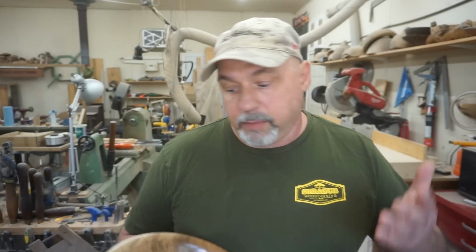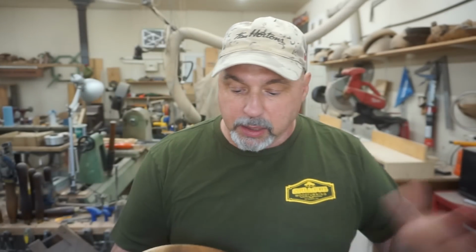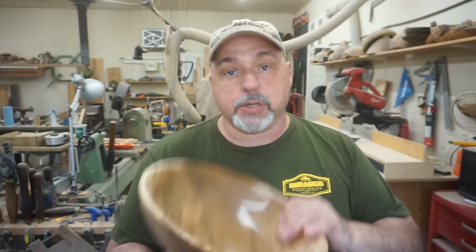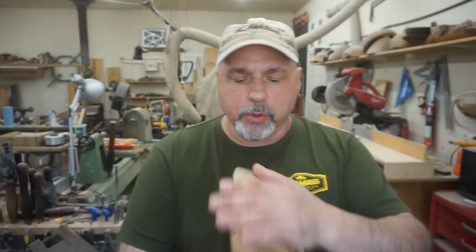It never even dawned on me until I was watching some YouTube videos on finishing tabletops with the Osmo, and they were using these buffers to put it in, and I'm like, of course. So that's where the idea with the Scotch Brite pad came from for the drill. Once we started doing that, it worked flawlessly. It was awesome. Again, Hampshire sheen on the top for wax for maintenance. I'm happy with this. I'm happy with the shine. It's smooth, smooth, smooth too.